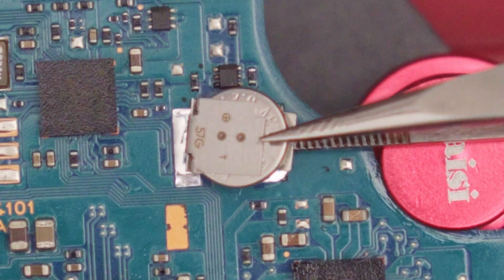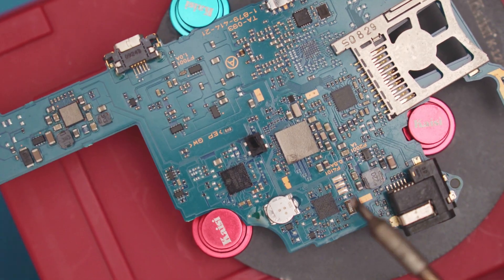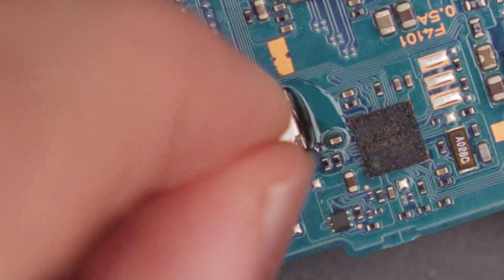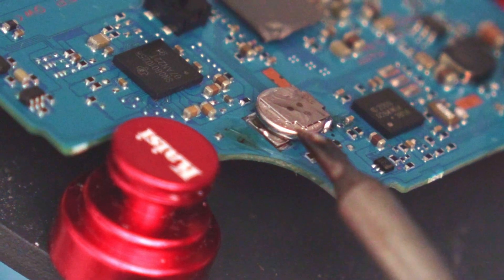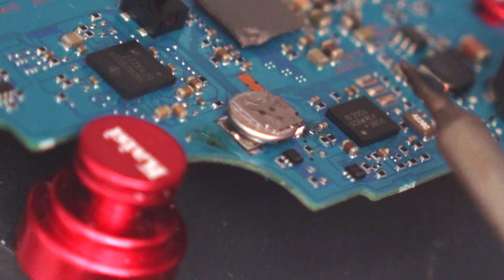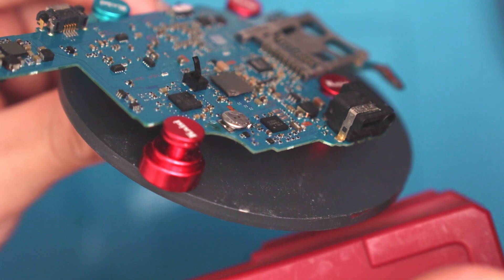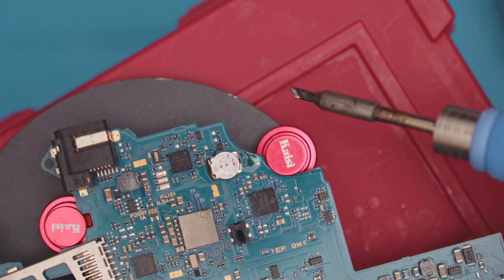For the replacement, it's going to be pretty much the same as before. Except this time we're just going to lay it on top on a nice flat, clean surface. Apply some flux to the sides and flip it. We're going to start off with the inner side as it is the easier, safer option. Just by touching it, the solder automatically goes under it and now it's secure on that side. Now for the other side, one thing you need to note is how close the edge of the capacitor is to the bottom pad — we don't want to bridge these two. If we do, it's basically a short circuit and a lot can go wrong. I recommend using the smallest tip you may have. Tap and hold until your solder flows through under, then ease out. To confirm with the 3000 model, we can use a multimeter to see if there's any continuity between the two polarities.